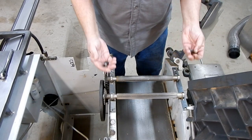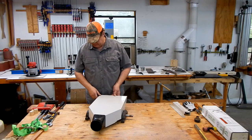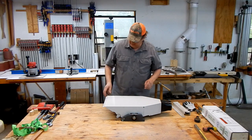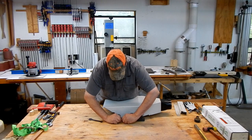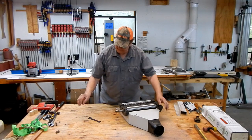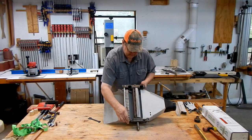Your two springs are going to be sitting up above and inside the cap. Taking it off with the shroud in place was a little bit harder, so I'll put the shroud on after I set the caps. Here's the assembly — first thing to do is get the shroud off. There are the other two springs. There are the holes on each bearing cap where the springs go in.